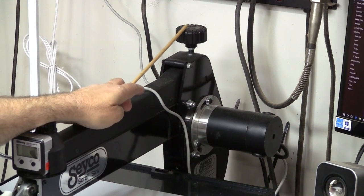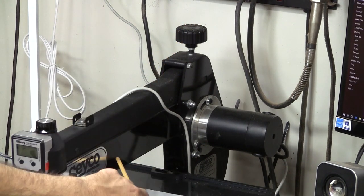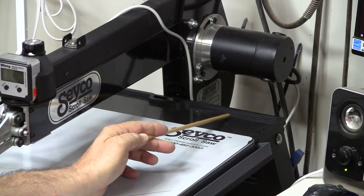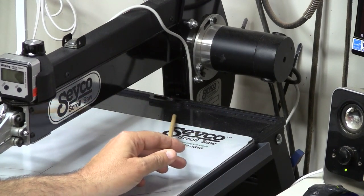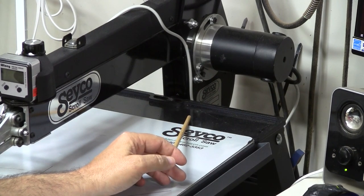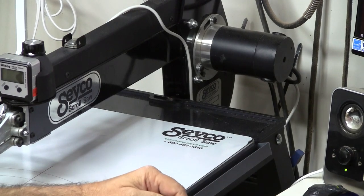What these adjustments allow you to do is change the forward-to-back movement of the blade to make it more or less aggressive in cutting. Other scroll saws have had this adjustment, but I'd never seen it explained in any manual. It actually enables you to set the parallel adjustment between the upper and lower arms, which gives you that forward-to-back movement in the blade. There's also a standard dust tray on the back of the machine that catches dust blown rearward by the dust blower, instead of letting it fall to the floor.